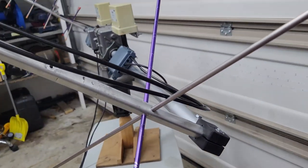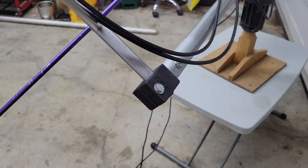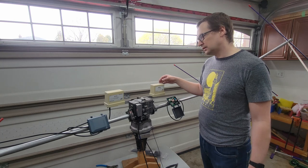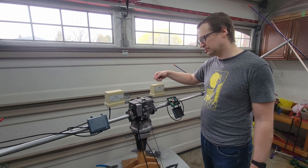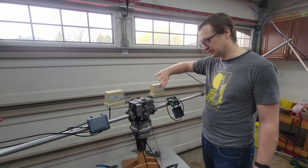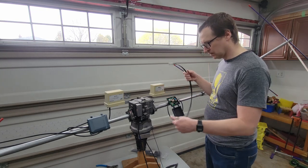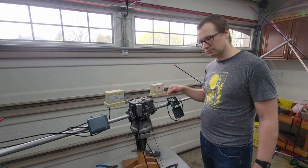Using these clamps I was able to align both antennas very precisely with each other. I haven't used this mounting method before — I'm still kind of new to 3D printing — but so far I think this is going to work out really well. You may notice I'm using a really nice set of SSB Electronic preamps, which were given to me very generously by a friend. I've mounted these across the back of the elevation rotor because it's a nice place to transition from the horizontal motion around the elevation rotor to the vertical rotation on the azimuth. It's just a matter of connecting the flexible cable from the switch into the preamp, a set of cables from the switch to the antennas, and then some LMR 400 series cable from the preamps running down the tower to the shack.